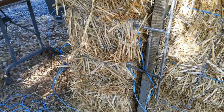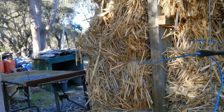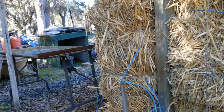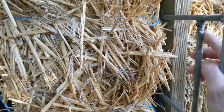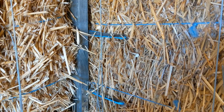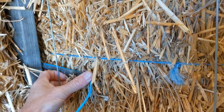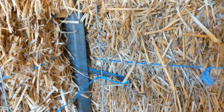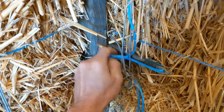Okay, that's through. Now we can pull that bale pin back through, and we've got our loose ends here. And what I'll do now is feed that back through the wall to work on that inside. Just make sure those are lining up okay. That's through to the inside. So here's the bale pin poked through to the inside now. Just going to pull those loose ends through again, making sure I grab the same side on each of the pins, the needles, and I'm just going to tuck that back around that tension wire so that doesn't cause any troubles. Would be easier with two hands.